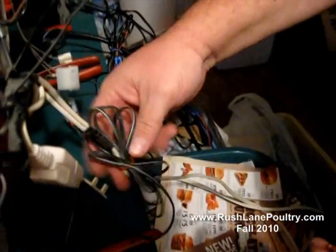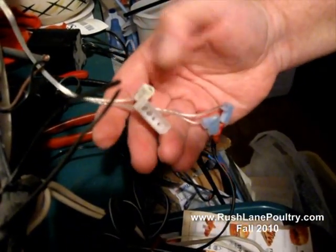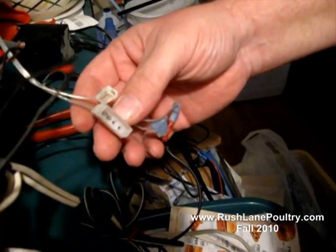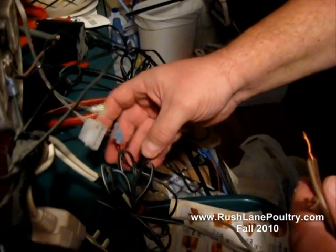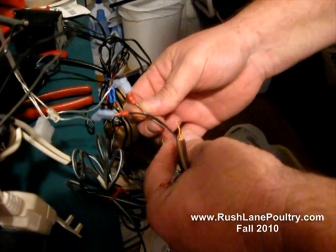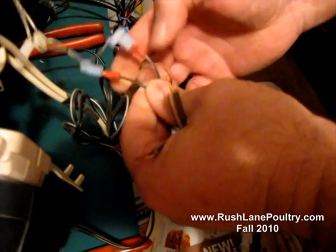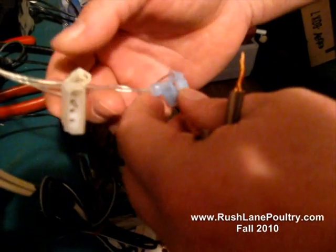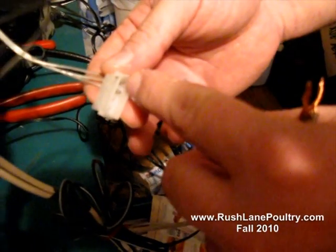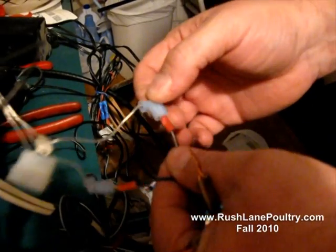On my power inverter, I take that wire and cut it right here on the end. I just put some terminals — sometimes you have to play around. The little fans come with different connectors depending on whether they're SATA or the other kind. You'll have to play around with it. Skin your wires, split them. Your positive side usually has a white marker on it; the negative side is solid black. White stripe is your positive or voltage side. Then just play around with touching — because one way you touch it to your fan it's not going to run at all, but touch it the correct way and you'll know which wires to tie in or which side to hook them to.